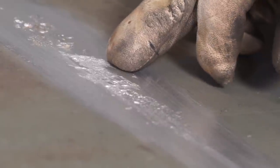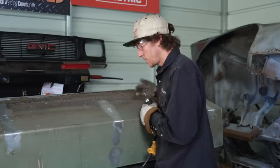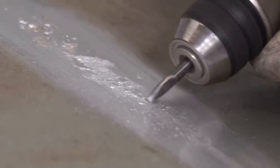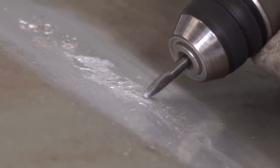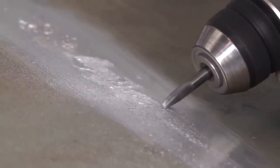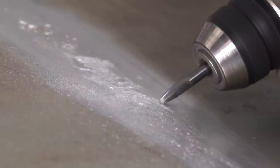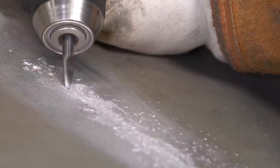You can see here how silver this spot is, and then you can see the gray in this spot — that still has the oxidation in there. When it really cleans up, you can tell all that oxidation is out of there. This is going to make the weld pool really clean. If you don't get all that oxidation out, you'll see it clear as day in the puddle. You'd have to push the wire in there and hope it brings it to the surface — so let's get it all ground out as much as possible for a cleaner, better weld.